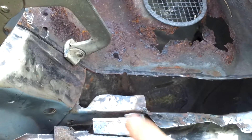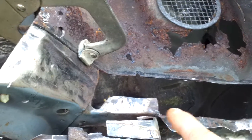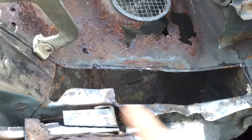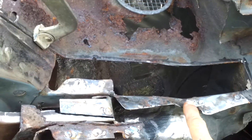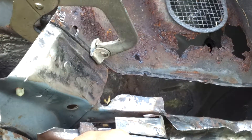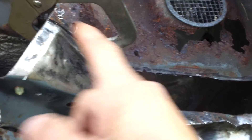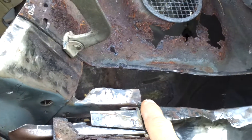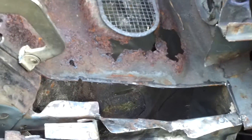Making that piece would be easier to just do it in three sections, or you can try to do the bend. I tried to do it in one piece and I wasn't getting anywhere because it all steps — it comes up and then steps up again. So three pieces would probably be easier. When you do it, you just do this curve and then stop here and bend the metal down, then do another piece here, bend it down, and then do another piece to go there.